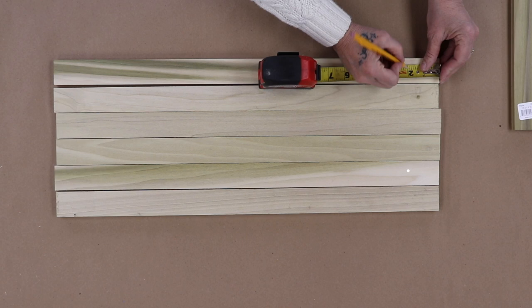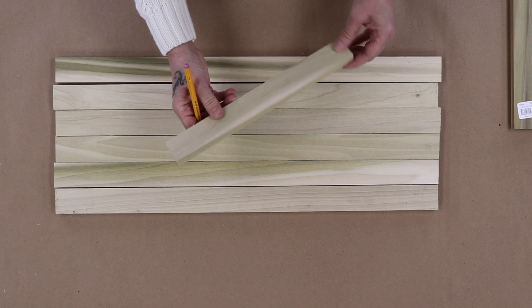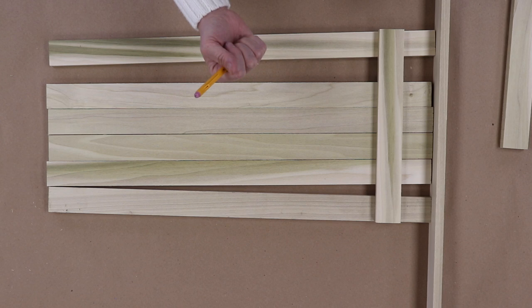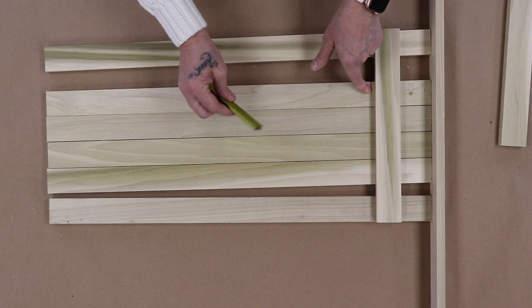Remember, we're working from the back side. These are where the cleats are going to go. You don't have to worry about lining this up right now — you're just going to be doing number one and number six. Take one of your cleats. Be mindful if it has stickies on it. Pull this out until the ends are flush and line up that tick mark. We are going to be gluing these down for extra stability. We're going to be using three-quarter-inch long staples because the wood is actually one inch thick and we do not want them to go all the way through.